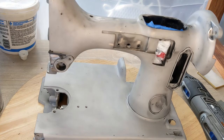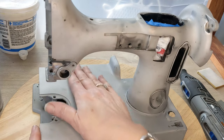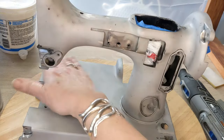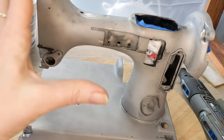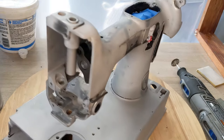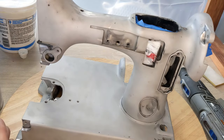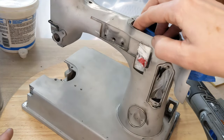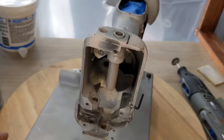After blasting her, there's always a cleaning process to get residual dust out from inside. Someone suggested — actually on one of Jen's videos — cleaning them with kerosene. I have a gallon of kerosene and a bucket. I just let the kerosene flow through, and any residual dust on the internals gets flushed out. Then I hit it with high-pressure air afterwards — it cleans out everything, all the gears are really good, no worry about rust issues.